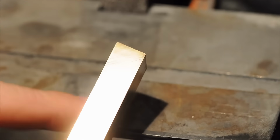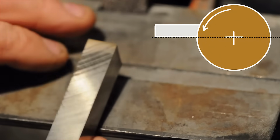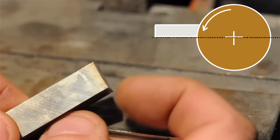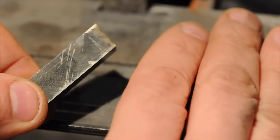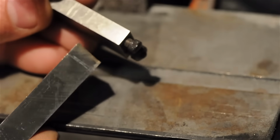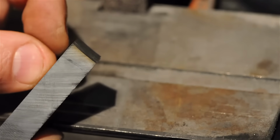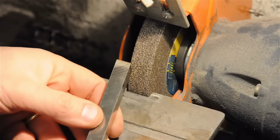My tool rest, like I imagine most grinders, is about the center line of the wheel, so we're above the center line of the wheel. It's grinding more on the bottom than it is on the top. If you're doing this on a belt grinder, you'd want to tip your table about 7 or 8 degrees down. So with one grind, we've gotten 2 relief angles. When we come against the work, this upper left-hand tip is the only thing that's going to be touching. All of this sort of falls away. All right, I hope that made sense.